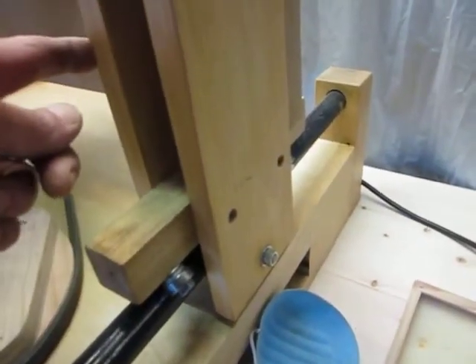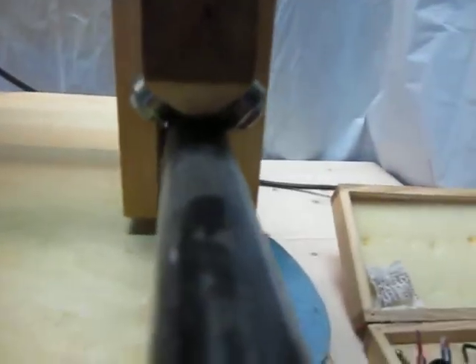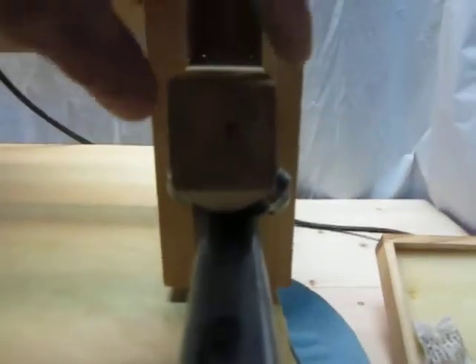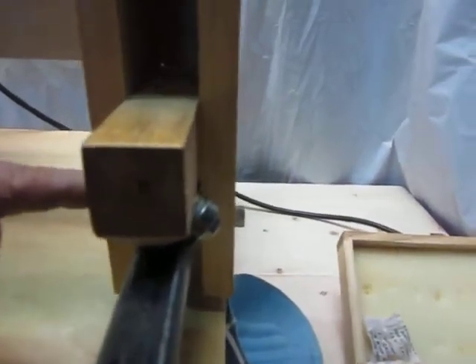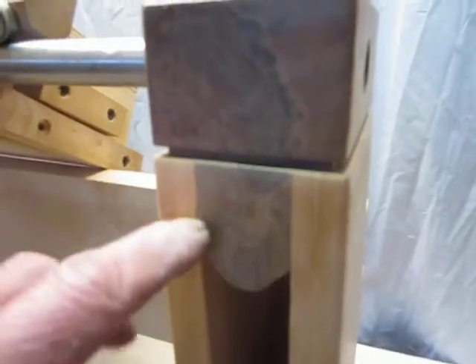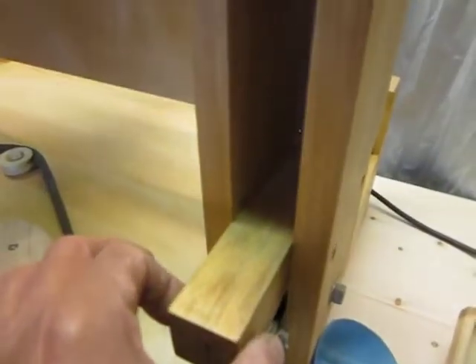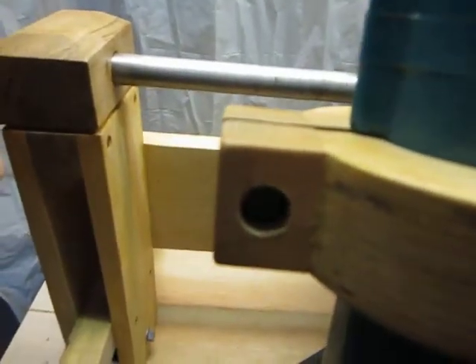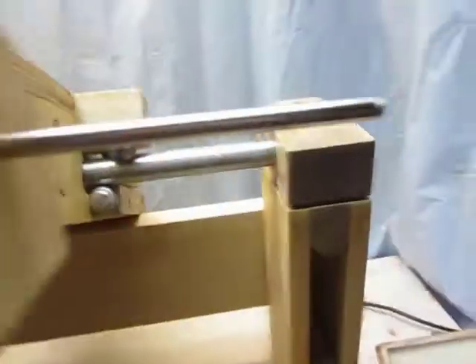The main part, as you can see, is fairly simple — basically just two boards and a piece with two bearings, one on each side of the pipe. Their position should be quite accurate, and they have to be offset so you're not going to run one bolt into another — just move them half an inch or so. I put another piece on top, the same thickness as the lower one.